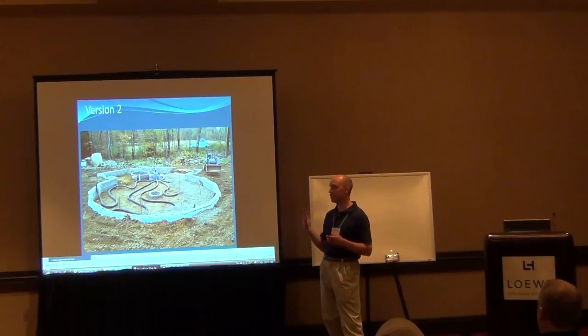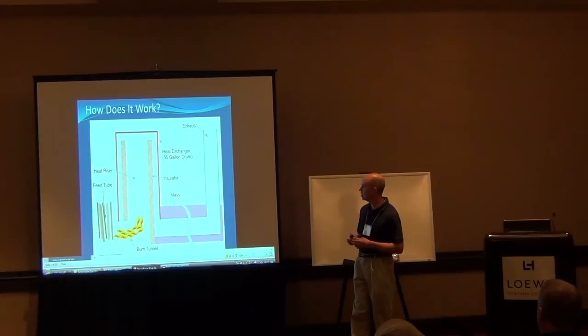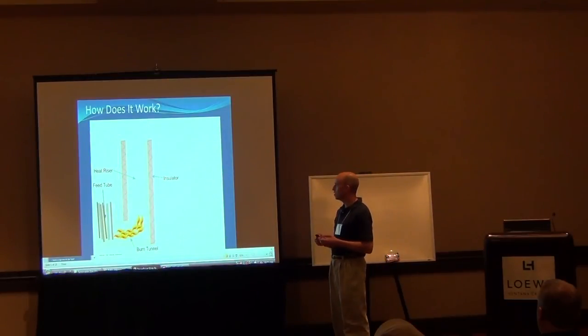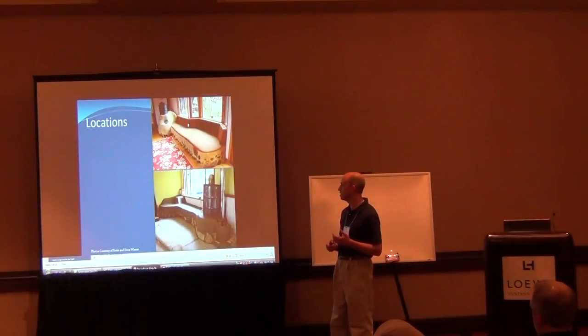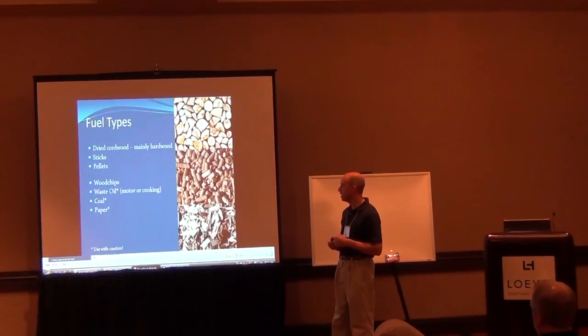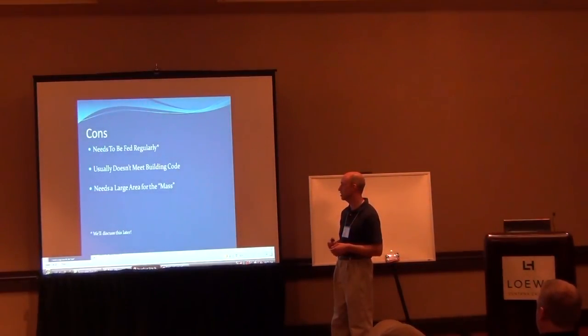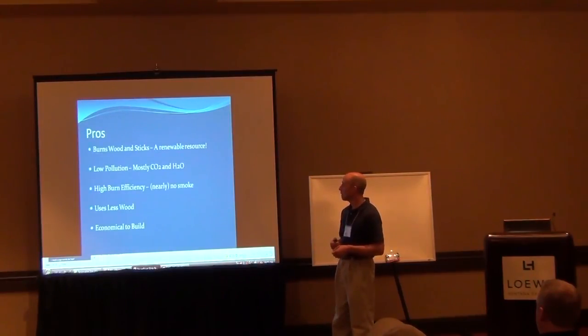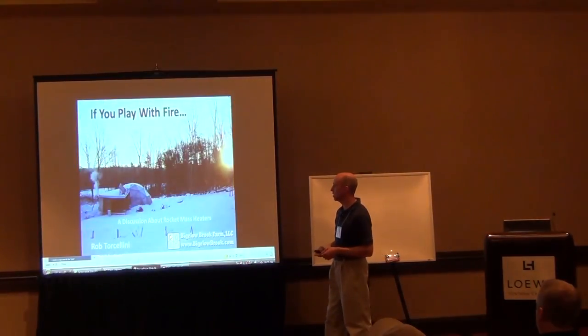And it's funny when you're watching these burn. I think it's on the first picture, the original one, if I can get to it. During about the first hour of the burn, you see a lot of condensate coming out of the system, because that's when it's burning out all the moisture in the greenhouse. And after that, I've actually gone outside because I thought the heater wasn't running at all, because you don't see anything coming out of the chimney. There's no condensate left because you're not burning out any of that humid air. We've got to go way back here. And so it actually looks like there's nothing burning.